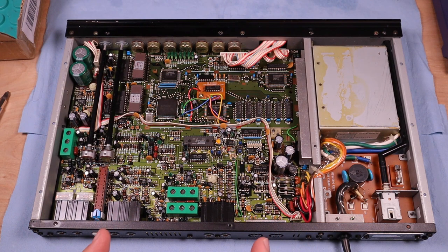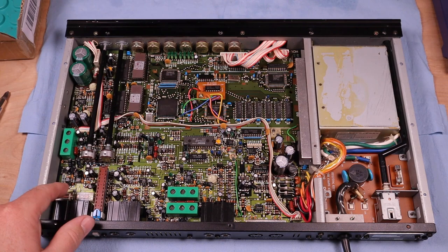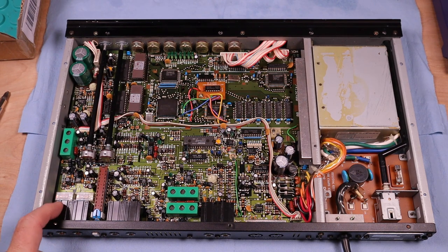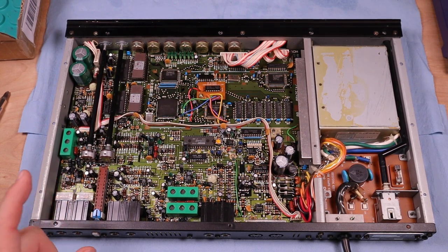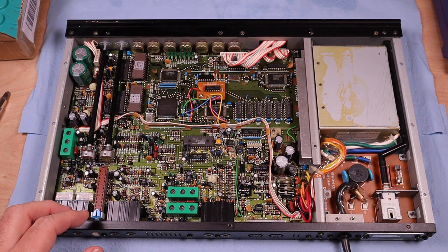So I think what I want to do is: number one, put a new battery back in it; number two, take a closer look at these relays. I've tried to service these before and you have to be very careful — they really don't take well to servicing. I do know that I can get a replacement for these though. Beyond that, I'm going to look at a couple of different solutions for maybe fixing these jacks, either trying to fix them — which I've tried before and it's not a good idea — or possibly replacing them with some other kind of jack. First thing, let's just replace that battery.